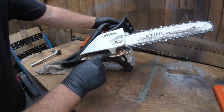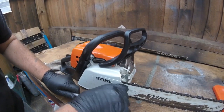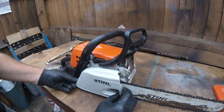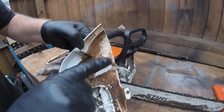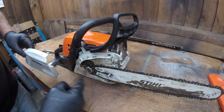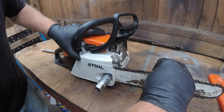What we've got to do now is unbolt this - I'm gonna give this a clean up from under there because it does look like it's got thick debris in it. So we'll undo that and give it a clean up. This just slides out - it's not as bad as what I thought really. I'll get the air blower on that and give it a blowout. The chain itself does not need tightening up because it's just perfect at the moment.